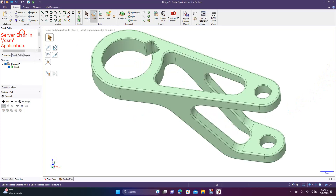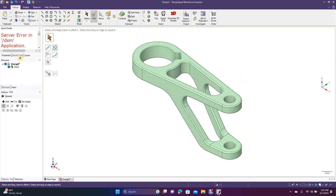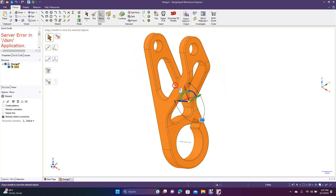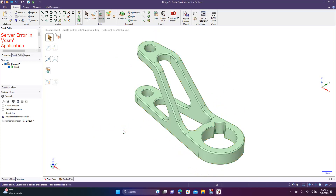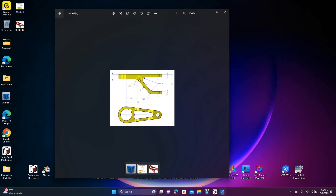Go to trimetric view, then top view — that looks good. Switch to isometric and rotate the part for a better picture. So this is the swing arm. The process is: draw the first shape, draw the second shape, extrude with no merge, position the second piece over the first, extrude with no merge, then combine them using the combine tool and you end up with a part that looks like this.